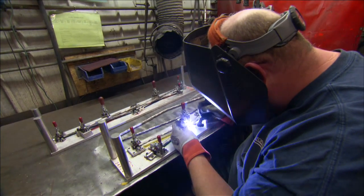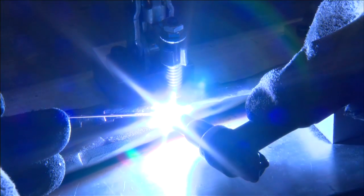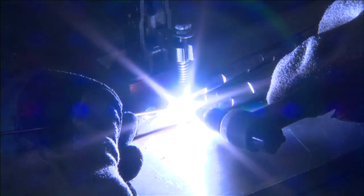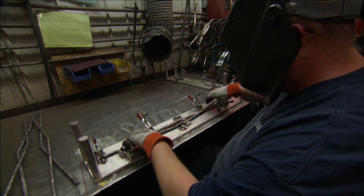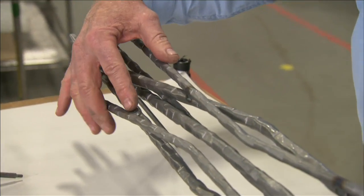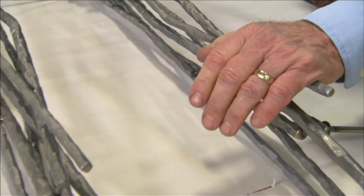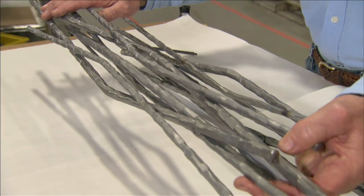Assembly begins in the weld area, where a series of three jigs hold parts in position for welding. The process is TIG welding — tungsten and inert gas — using an electrode that strikes an arc, creates a liquid pool of steel on the part, and filler rod is added for a strong weld. Ed takes two twigs, welds them into a pair, then takes three pairs and welds them into the final product. After welding, the product is washed to eliminate the weld bluing and prepare the surface for painting — it has to be super clean.